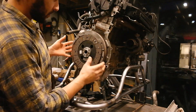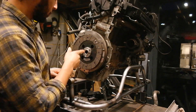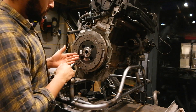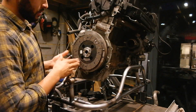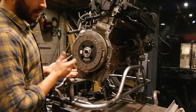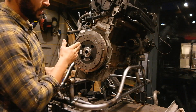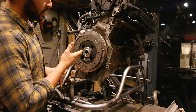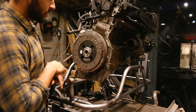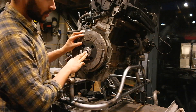We're now putting the clutch assembly, flywheel, and bell housing back together permanently. I've put threadlock on the flywheel bolts and I'm dropping in the clutch. This clutch is specifically made for — I think it's more intended for — P38 conversions using the P38 bell housing and flywheel. It is a P38 clutch, but this thing is heavy duty — off the top of my head it's good for about 650 Newton metres, which is way above what this engine is going to put out. This will hold a lot more power than the R380 transmission will.